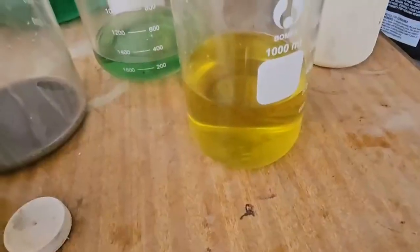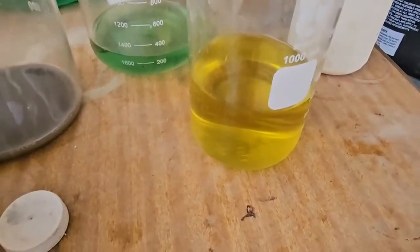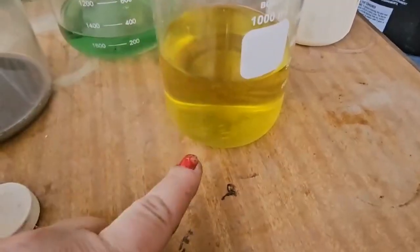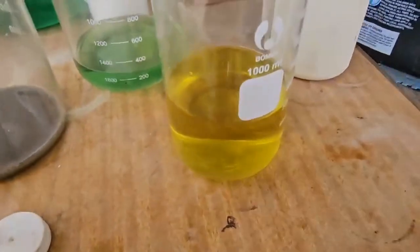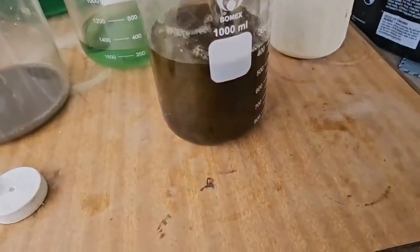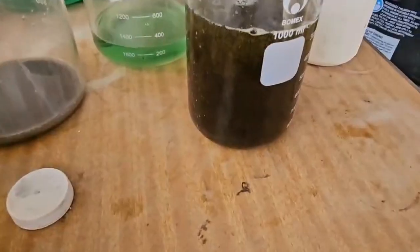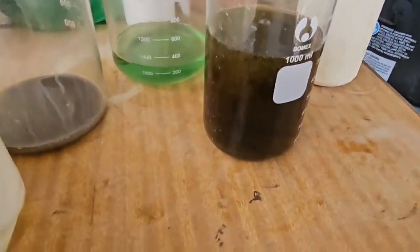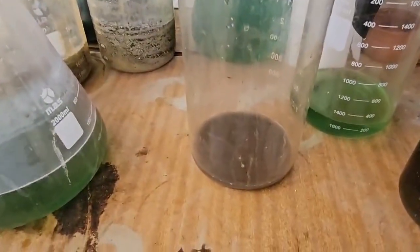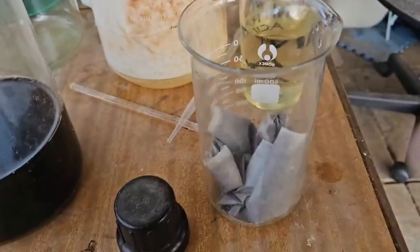Peter wants to see the drop, and I can add the gold powder from the filters to the drop — that makes sense. So I'm going to put iron sulfate in — about double the quantity of what's in there. Nice color change! See, I'm getting better at this. I'll let that drop the gold and then pour it into those filters. That's the last bit of the dregs at the bottom and then I'll add that to it.